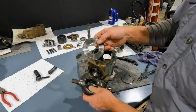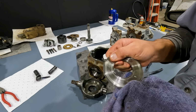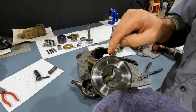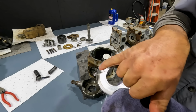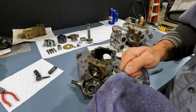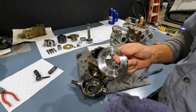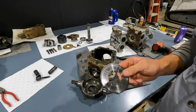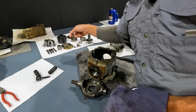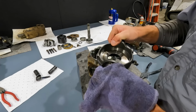So just like everything else, it's really important that this plate is in really good condition. And unfortunately, just like the heads of our slippers, we've got a lot of wear out here on the outside of it. I can really feel that with my fingernails. So yeah, charge pressure issues all the way through that. There's nothing destructive in this pump. It didn't do a catastrophic failure, but it is pretty much worn out. So we would have low charge pressure issues, and I would say probably hard steering on this pump, based off the evidence that I've seen so far.